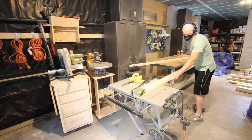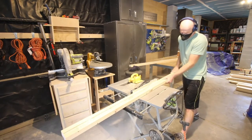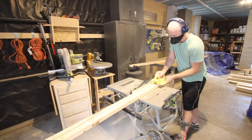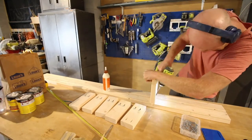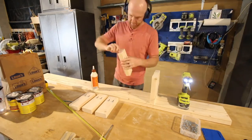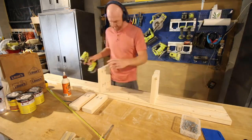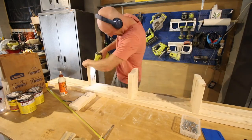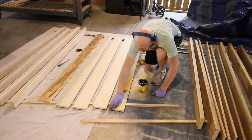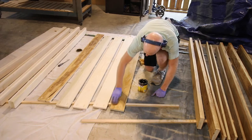There were lots of pocket holes to drill on all of the headboards, and then it was time to cut down the support beams. We weren't too worried about the support beams in the middle being visible, so for these we did use more rustic two-by lumber instead of hardwood. These were two-by-fours that we cut down to be the supports in the middle, and then glued and Kregged in some legs to hold up the center supports and support our weight.